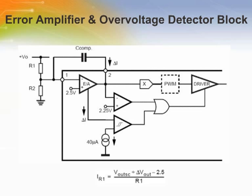The error amplifier inverting input, through an external divider connected to the output bus, compares a proportion of the boosted output DC voltage, VO, with the internal reference so as to maintain the pre-regulator output DC voltage at a constant level. The error amplifier is used for frequency compensation, usually realized with a feedback capacitor connected to the inverting input. The error amplifier bandwidth will be extremely low because the output of the error amplifier must be constant over a line half cycle to achieve a high power factor.